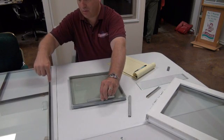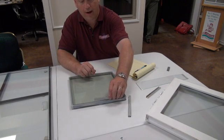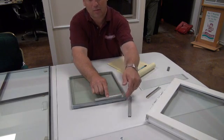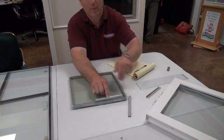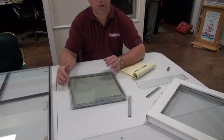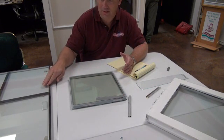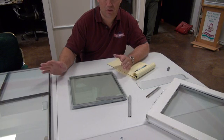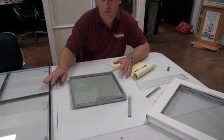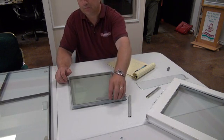The spacer is placed on raw glass with no sealant — it's glass touching metal. Once sandwiched all the way around, the other piece of glass goes on top, and then a hot melt type sealant, also called polyisobutylene, is wrapped around the perimeter. That's the black stuff you see around the edge. This design is not meant to last more than five, six, or seven years tops — some fail in the first year.